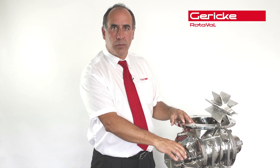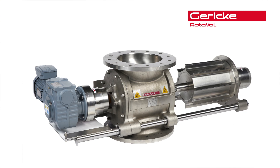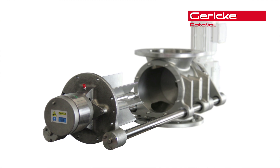Operational maintenance is to do with being able to take the actual valve apart while you're still actually in situ. Our fast-clean version, HDMF, is actually a device that can pull the end cover and rotor out as one piece. You can get in, clean the rotor, clean the pockets out, clean the clearances, clean out the bore, and then put it back together again. It's all pre-set and you're up and running.